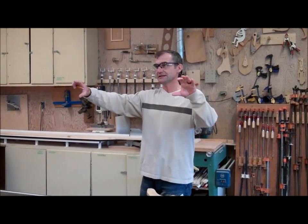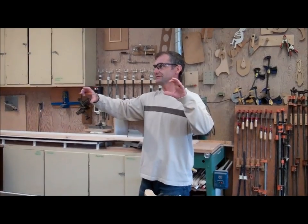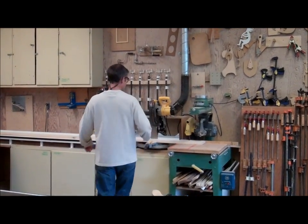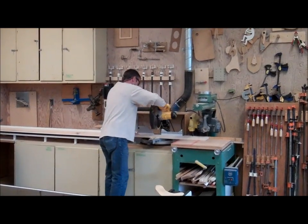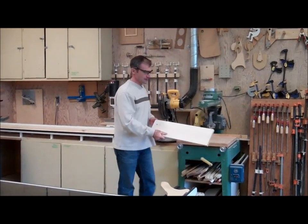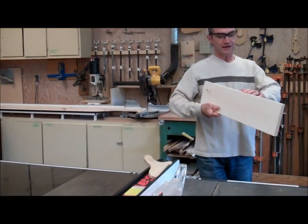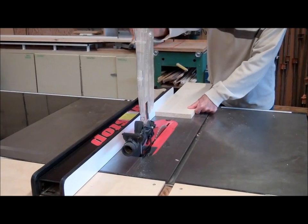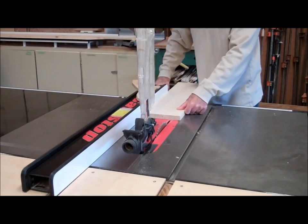My wood stock — because my pieces are kind of laid out lengthwise — is five inches by 24. This is a piece of maple. I'm going to cross cut it at 24, then come over to the table saw and rip it. My finished surface goes against the fence, and I'm just going to rip a fourth surface edge on here.